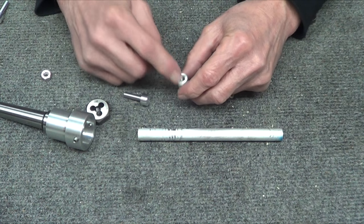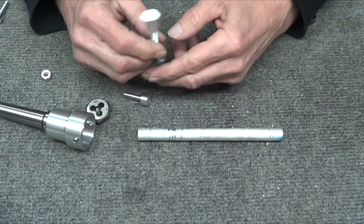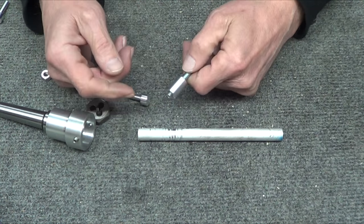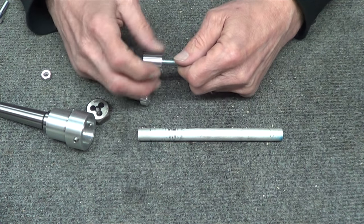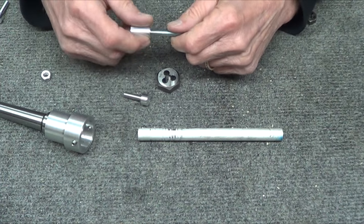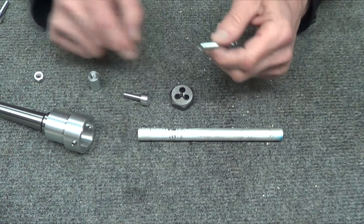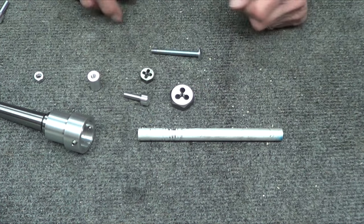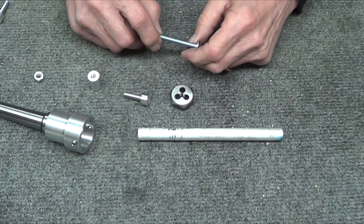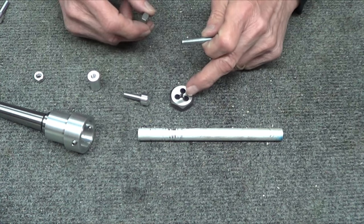Is there a problem with the thread protector itself? I run a quarter-20 bottom tap all the way through it — it's fine. I get a quarter-20 screw and it runs all the way through smooth and easy. So that's good. What gives here? I ran the die back over the threads and it's kind of loose, flopping around. Is there something wrong with the die? So I try a borrowed quarter-20 die — I run it on the part and it is tight, starting to cut the galvanizing off. So that one's loose, this borrowed one is tight — that die has a problem, I think.